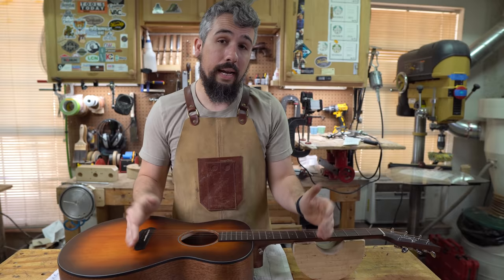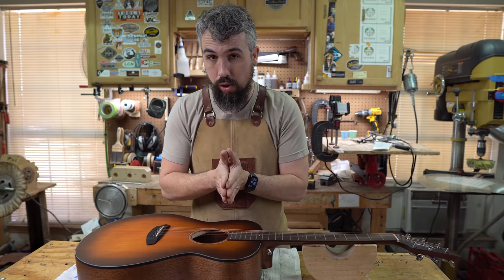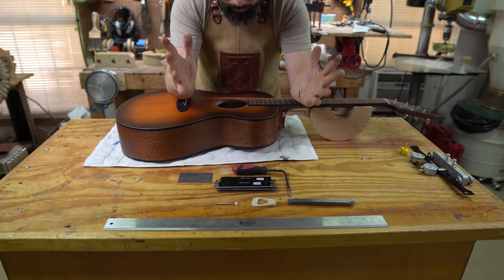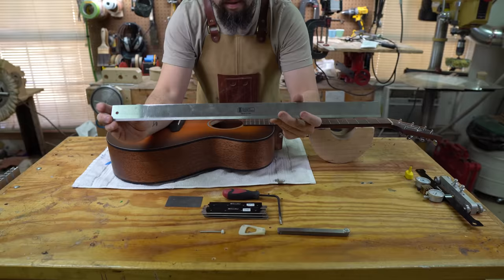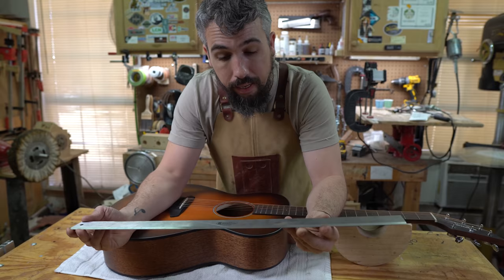The first thing to talk about is tools. What we have in front of us is roughly $300 to $350 worth of tooling — it doesn't look like much, but these are the bare minimum you'll absolutely need. The biggest chunk of your money, believe it or not, is just a straight edge. On paper it looks like you could use anything, but we'd recommend a high-quality machine straight edge because your setup is only going to be as accurate as the machining on it.